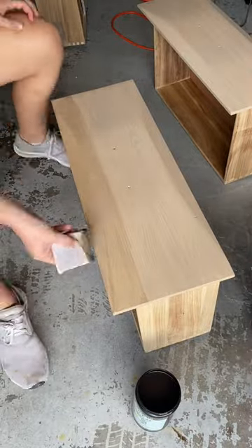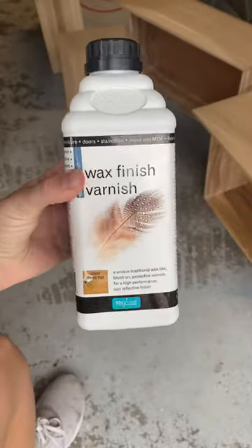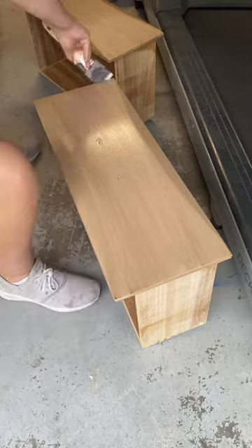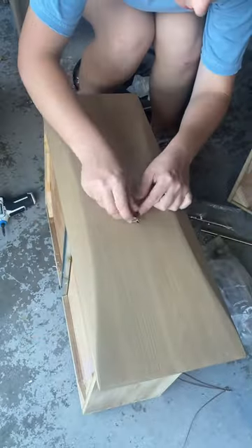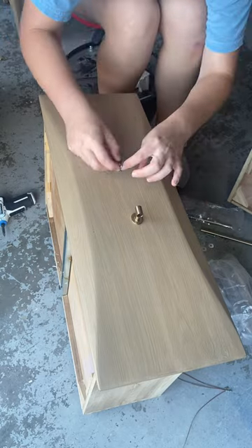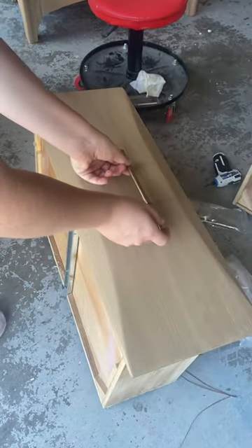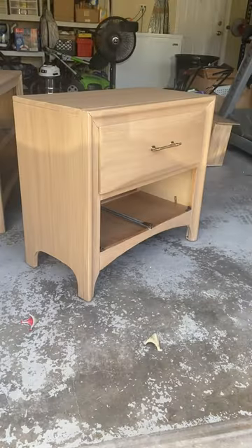I've applied this with a brush in the past and I found that this Maker Stain Pad works a lot better. I use this Polyvine product anytime I'm going to brush on my topcoat because it looks so much more even than a normal poly. To finish it off, I grabbed my adjustable hardware so that I didn't have to drill or measure any new hardware holes. I think this really elevates a piece of furniture and makes it look more expensive, so it's worth the investment.